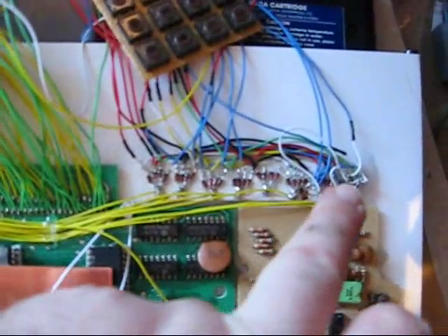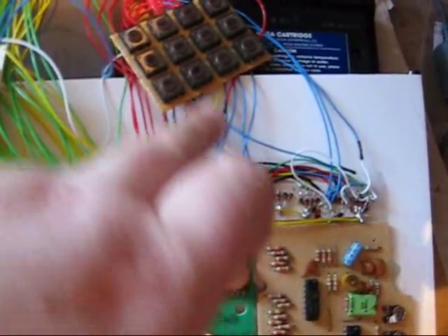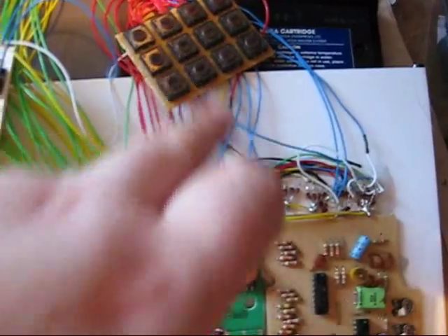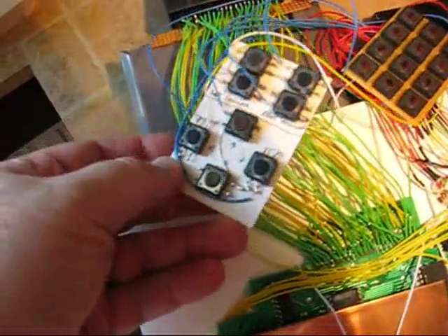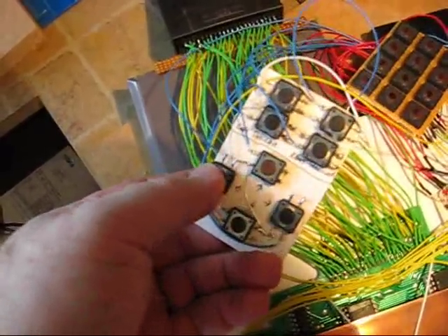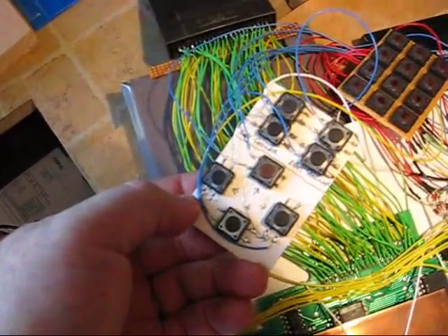With the matrix, this is how we've had to connect it together via diodes, just to make sure that the signals only go one way. You can see the sheer amount of wiring involved to get the keypad and the D-pad working. In reality, I've tried several games with just a standard four-way, and it does actually work very well — there are obviously exceptions, as you'd expect.